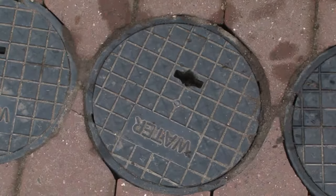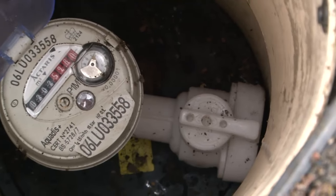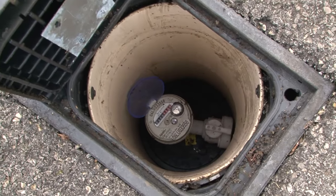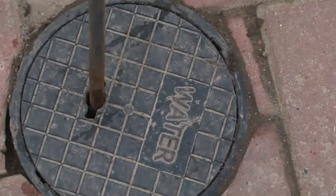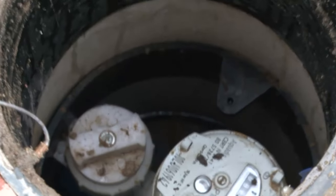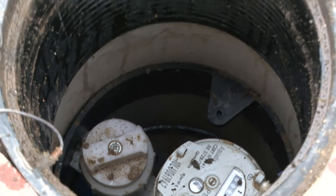There are a number of different stop taps — here are the most common ones. This stop tap is located underneath a square plastic lid and to turn the water supply off it's a quarter of a turn anti-clockwise off and quarter of a turn clockwise on. The stop taps located underneath the round plastic lids require a clockwise motion approximately nine times to turn off and an anti-clockwise motion to turn back on — very similar to how a kitchen tap operates.